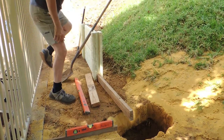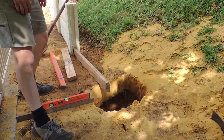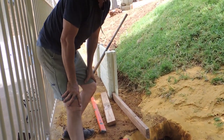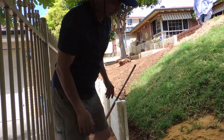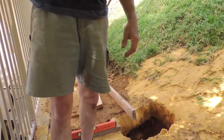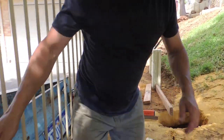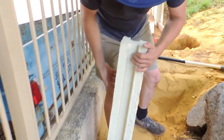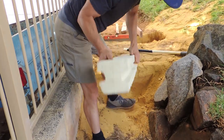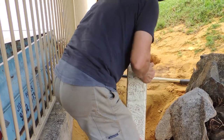To help ensure it stays upright, you don't need any fancy tools — I just use the mattock to support it at the other side. If you do it right, you should only need to grab the post once and the panels once, and that really saves a lot of back-breaking effort. It's hard enough digging the hole. Also — sometimes when they mould these things the ends don't always come out too good, so find yourself the good end that looks a bit nicer.